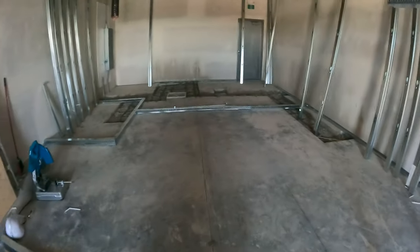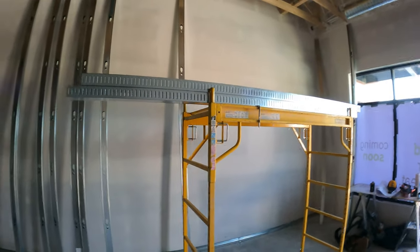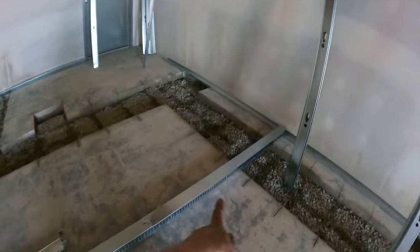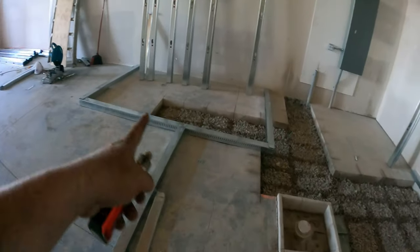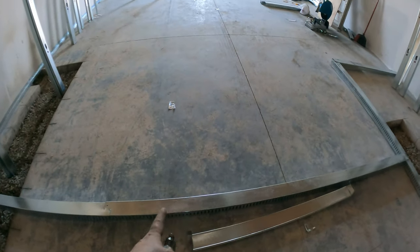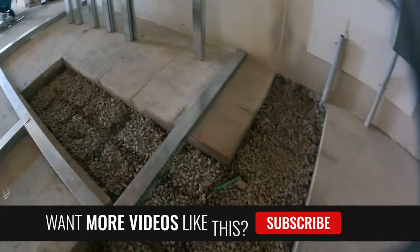Working alone, I'm doing this back furring wall 10 feet at a time — it's just easier when working solo. You can see I have all my top track done and I've pre-cut the tabs on either end. I have the fishtail ready and I'll screw this section together, frame it, then put a stud in the middle on my baker and put the whole section up at one time.